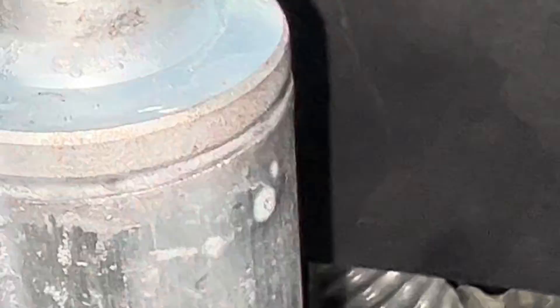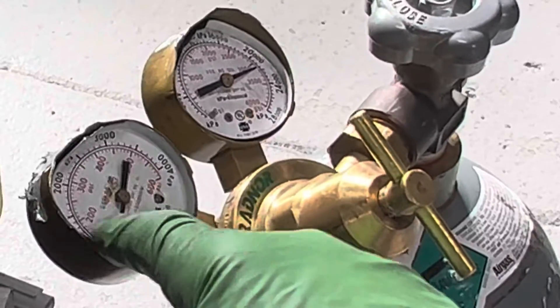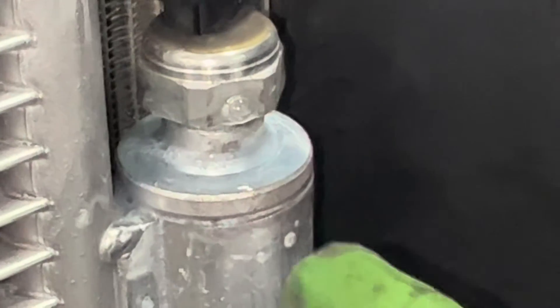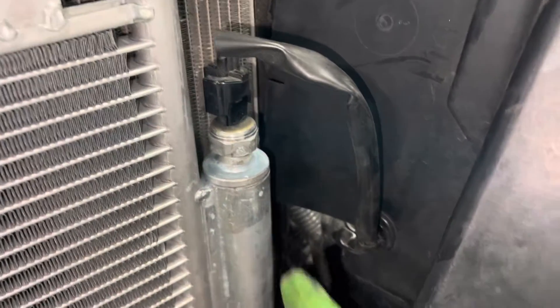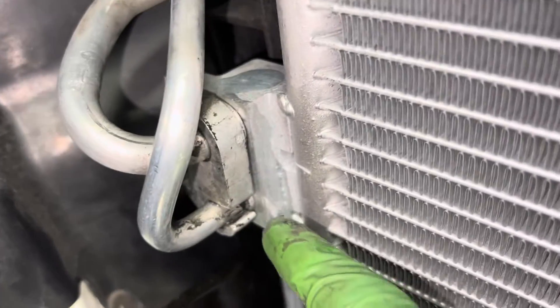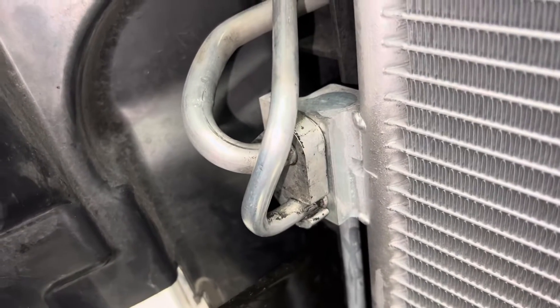That's what I'm looking for right now. I have it under nitrogen. My gauges are all busted up and don't work — I do things by ear and feel, but you don't do that, I do that. We're looking for a leak here and inside here, because aftermarket condensers on top of using o-rings don't always machine correctly where the o-rings have to be placed.